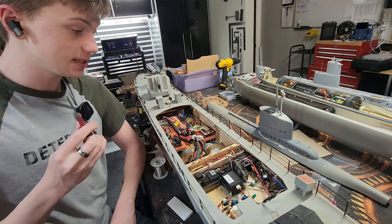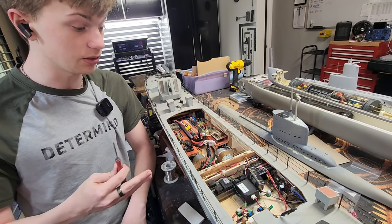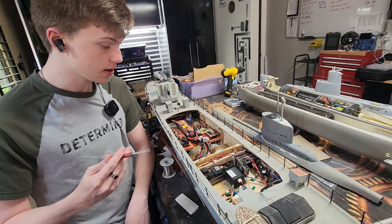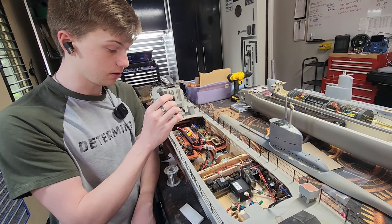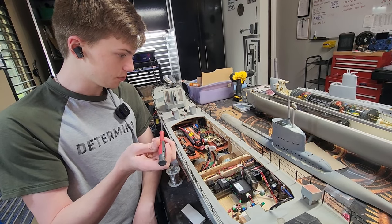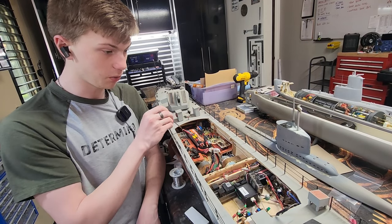Yeah. It seemed, the first time we looked at it, we figured they were rigged in series as a way to increase the voltage. Let everything be 12 volts, so you just install multiple 6 volts. But we hooked up one of them, checked using the multimeter on the others, and no power is going to them. So after a lot of poking and prodding, we eventually just decided screw it and started plugging them in one by one and testing the functions.